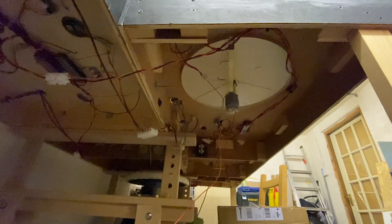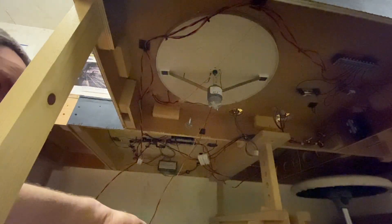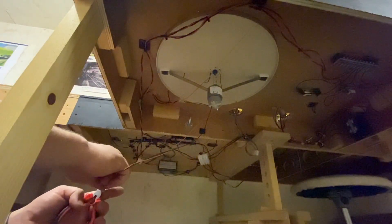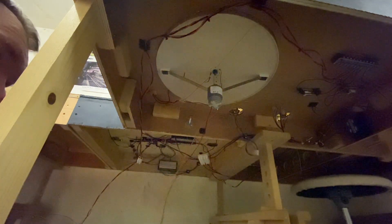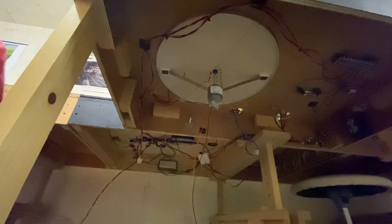So we'll crack on with it and see how we get on. What we'll do is cut these wires here, and we'll also unscrew these two wires just here — these are going to be where our power feeds join up. So what we'll do is tin those and tin them together.